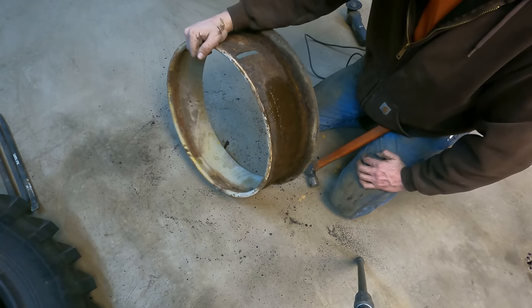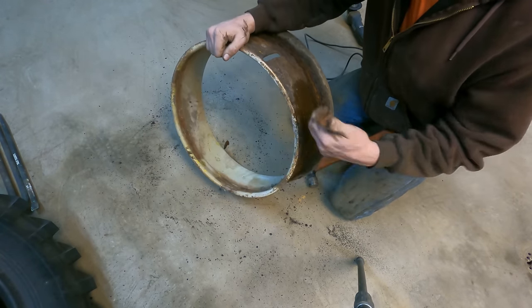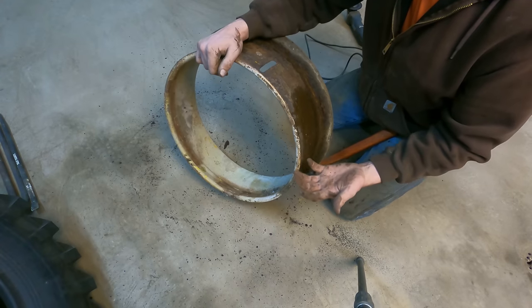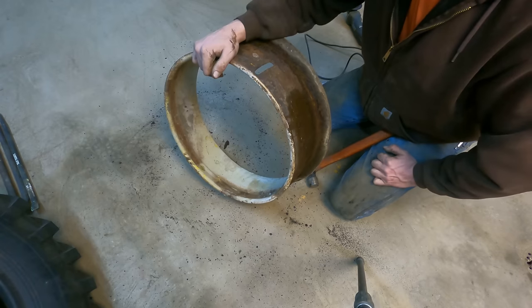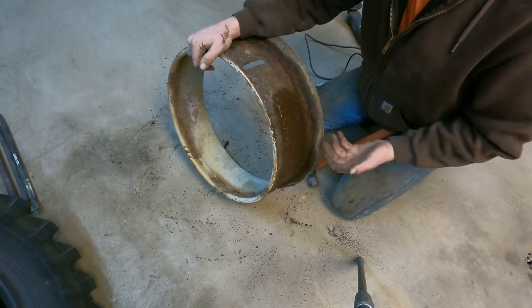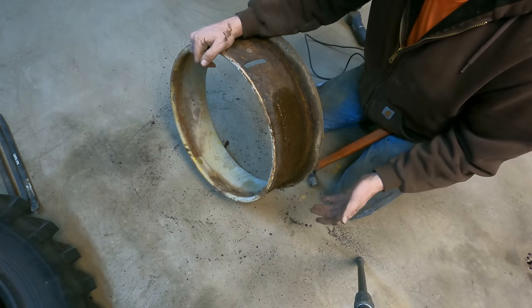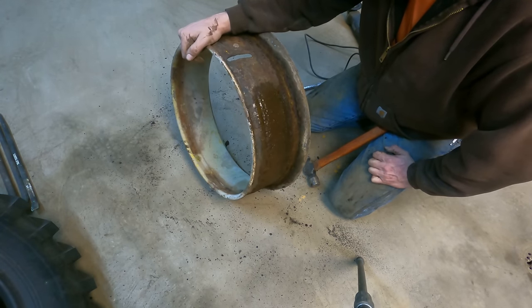So what I do is I set my regulator on the compressor to whatever pressure I want to put in the tire, and I make sure the ring is engaged properly and seated how it's supposed to be. I'll wrap chains through the rim and around the rings so that if something were to happen, it's contained and it can't go flying across the garage and take off my head. And at that point, I'll stick the tire chuck on there, a locking tire chuck, and I'll let it start to take air, and I'll just walk away. And it'll fill itself up to max, whatever I have the regulator set to, and then it should be good. I'll come back, cautiously approach it, make sure everything looks good, and then I'll go ahead and disconnect the air and take the chains off if everything's all right. And knock on wood, I've done a bunch of these and never had an issue.